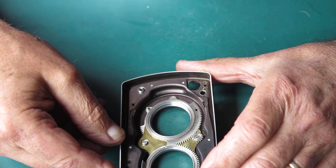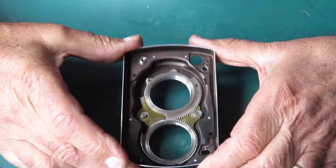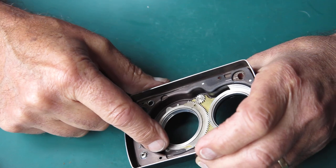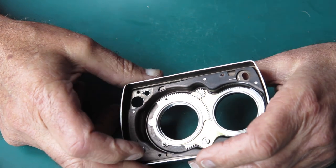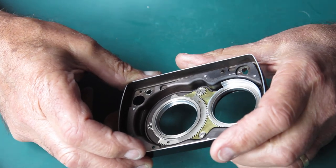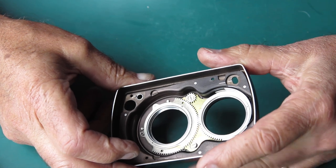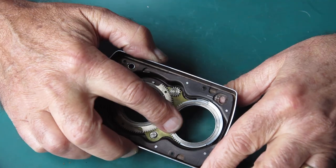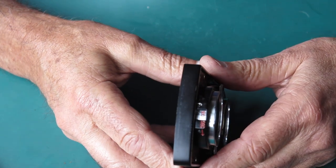It was tedious — tedious doing it, but mostly tedious working out what I needed to achieve. Once I knew that I needed to have the dials at the bottom — the parts that couple to the shutter itself — move from hard stop to hard stop, meaning they're moving through their full range, I could see that these parts had to be correct. There was no way for them to be incorrect. All I needed to do was make sure the scales at the top are timed to them so that at the limits of those travels they display the appropriate numbers.